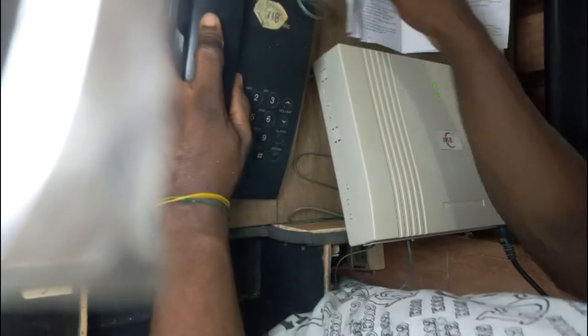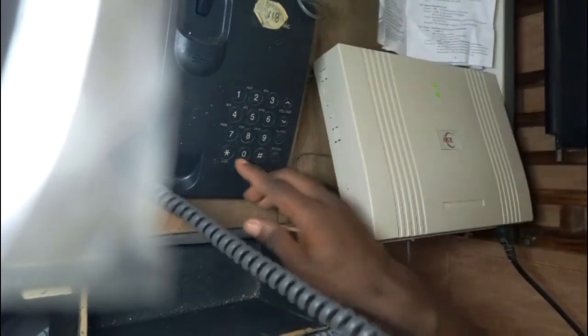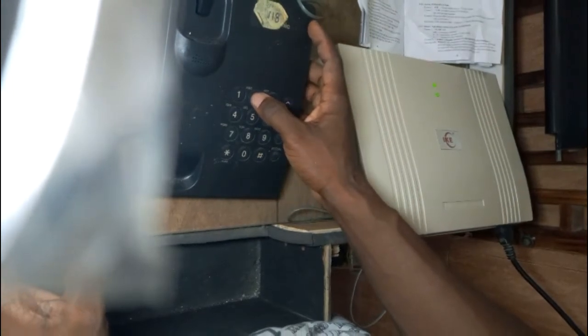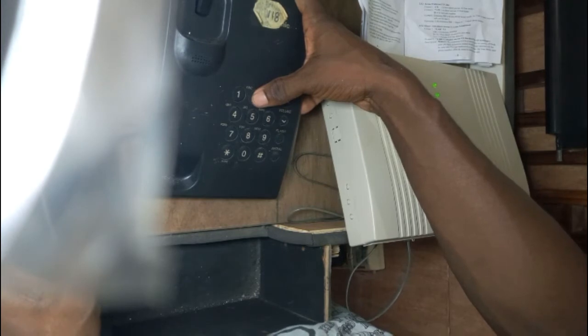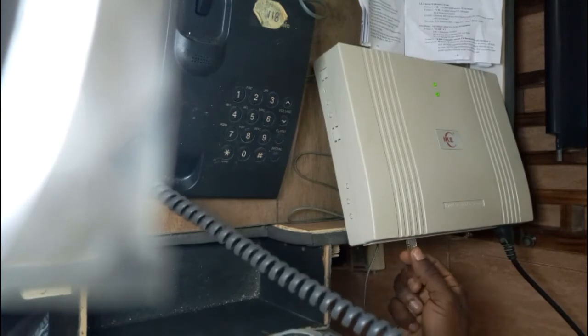From the manual, it says that from the first one we can actually program every other number that we want. Since it's connected to the first one, which is 801, from there I can get any other number. If you're using it for the first time and you plug the intercom into the first extension, which is 01, you're going to press *801#. That is going to program 01 as the master or the administrator. From this you can program every other number that you want.